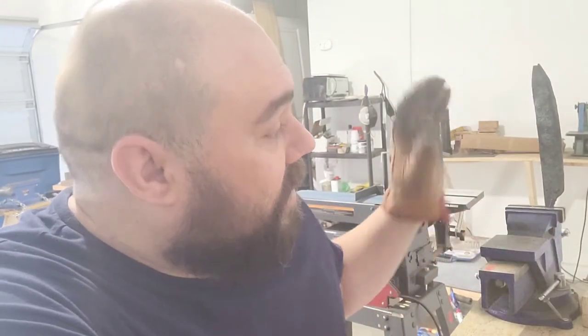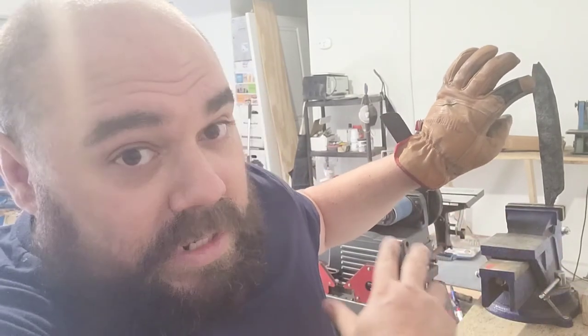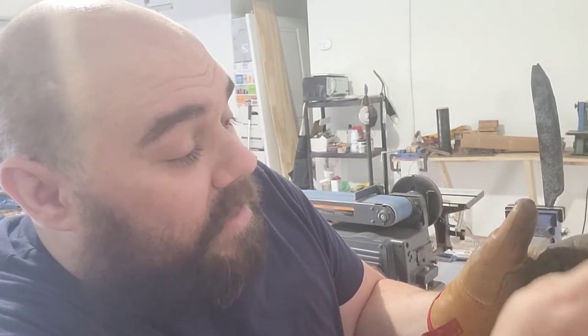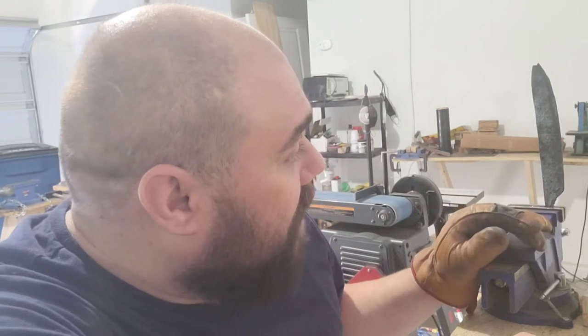This thing is still really hot — I can feel the heat coming off of it, so we can't touch it until it cools down. That'll be on a different video when I'm doing the grinding and shaping and really putting it together and getting a nice finish on it. But it's important for me when I'm doing my knives to pound that bevel in right here, because it'll compress that metal more and more toward the point. So when you do grind it off and sand it, it'll bring out that underbelly steel — the 1095 — and pull it forward, and you'll have a nice hamon pattern when you go ahead and etch it.